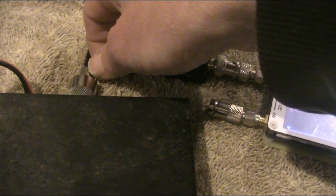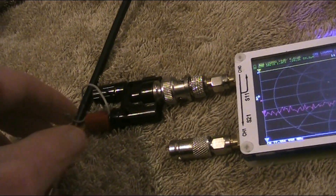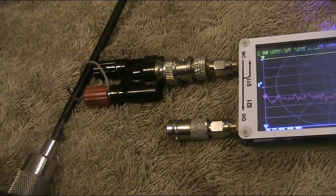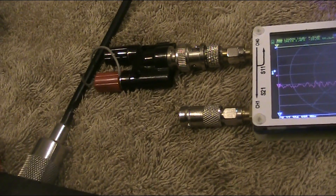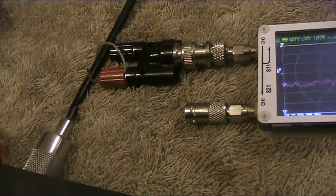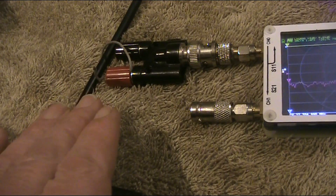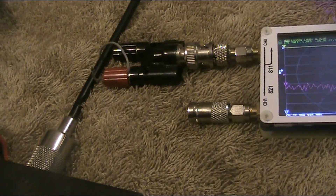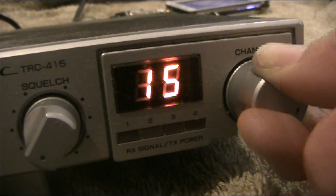It's probably overloading it a bit. Now I've got the wire wrapped one or two turns around the antenna lead, and that's probably the ideal amount of RF injection. It might need to be a bit more if your signal coming in is very strong, or a bit weaker when the incoming signal is less, so you might need to adjust the level a bit. Then put the microphone up to about one and a half when you flick around and aren't hearing any activity on other frequencies.